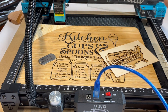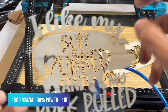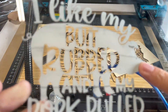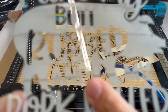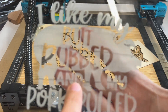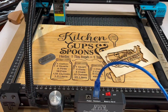Let's take a look at what I engraved. Starting with this cutting board — I used Tempera paint because it easily washes off, and did this at 1,500 millimeters per minute at 90% power. It's not my nicest brush job — a little too thick on the overlaps, and this D had a little bit of a blob. It didn't burn through that blob. Pretty disappointed — I'm usually a lot better than this. It's definitely not the laser's fault, it's all my fault, but it's permanently etched.